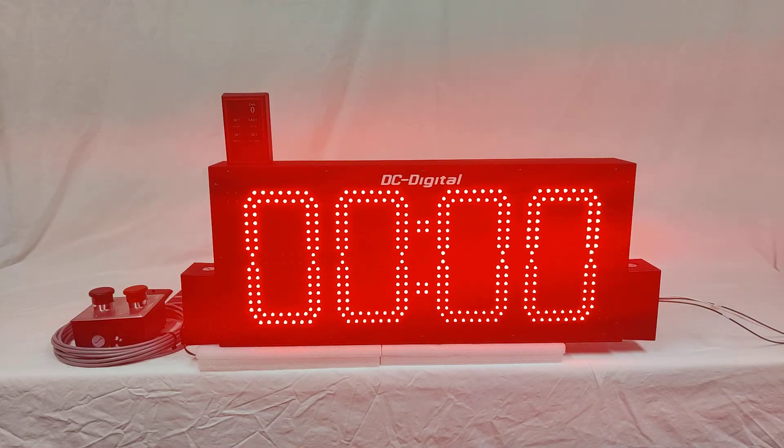This is a unit that's being used in large-scale production to communicate the time remaining to complete a project or product, and to track overtime when the target time is not met. So it counts down from a set value. When it gets to zero it starts to continue counting, measuring the elapsed time past zero, and to indicate that it's elapsed it blinks once per second and it's still counting up to track that time.